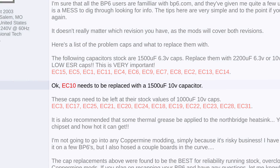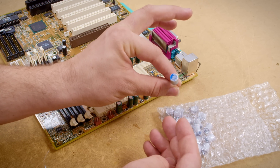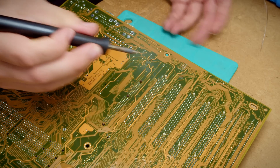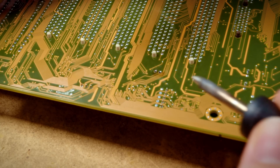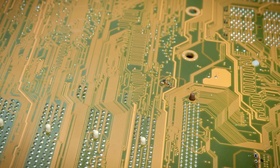There is a reported upgrade to make by replacing one of the capacitors with an all-around larger one, but I decided not to try that this time around, as I was looking more for original replacements rather than to start modifying the board. With the parts on hand after ordering, it was just a matter of putting them in. I decided to do this on a stream on Twitch. I haven't repaired a motherboard this new, but I've worked on plenty of other things that I was confident in my methods. I haven't made the plunge on a vacuum soldering iron yet, so I still use a solder pump. The key to using one of those without risking damaging the traces is to build up a muscle memory to immediately pull the iron melting the solder away from the pump before you suck up the solder.